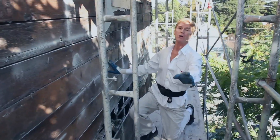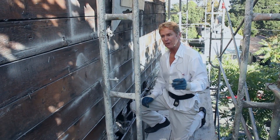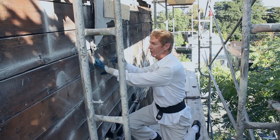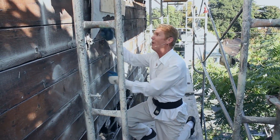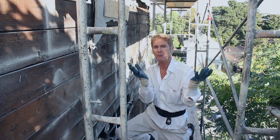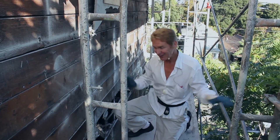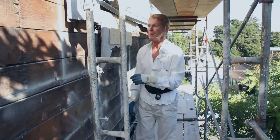If you're going to take it off — and we used to do it all the time, though I don't do it anymore because I'm tired of inhaling poisons — do it in three-foot sections. Cut a couple verticals, start at the bottom, crisscross them, and the nails hold it in place. When you cut the wires it can fall off. My brother and I had an instance where we had a four-by-four foot piece. Jay cut the last wire and the whole thing was too heavy — it fell through our hands, ripped our gloves, and went through a kitchen window. Fortunately nobody was home. So if you're going to tear off, guys, work in three-by-three sections and know what you're doing.